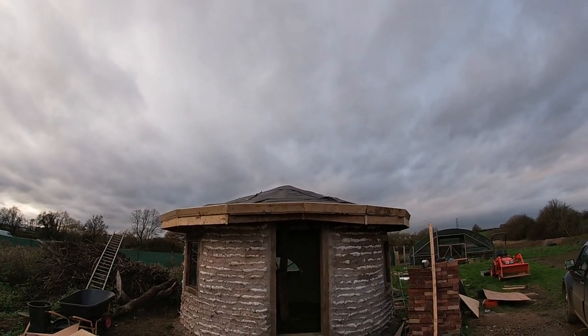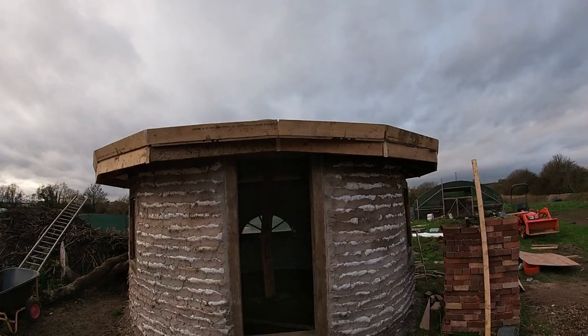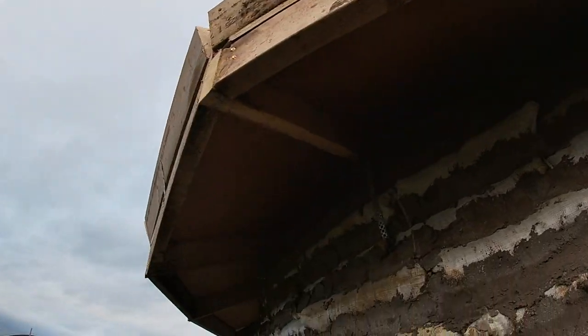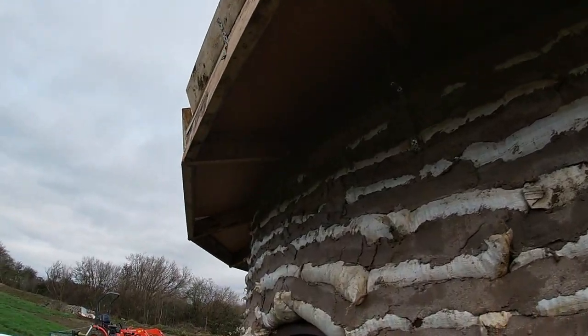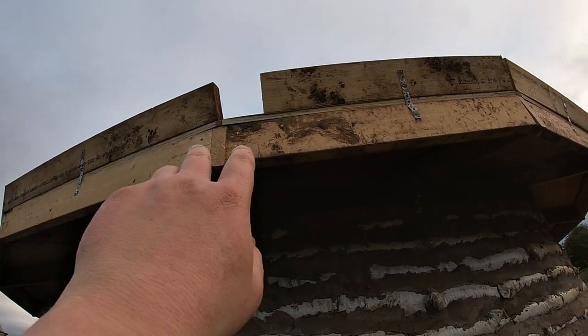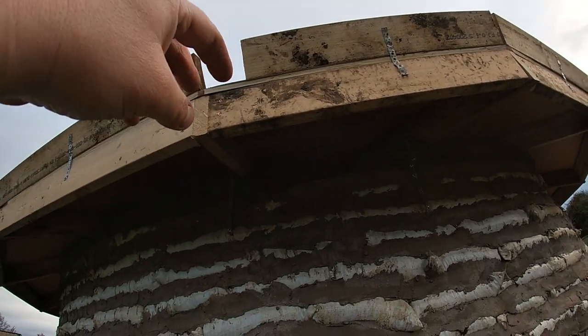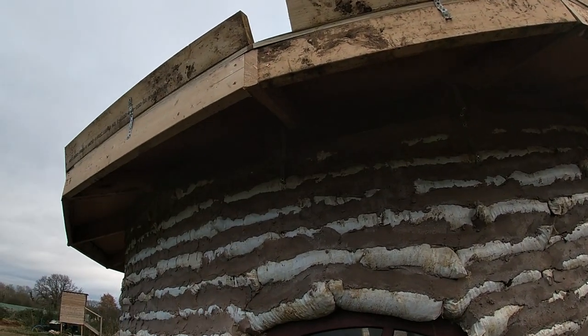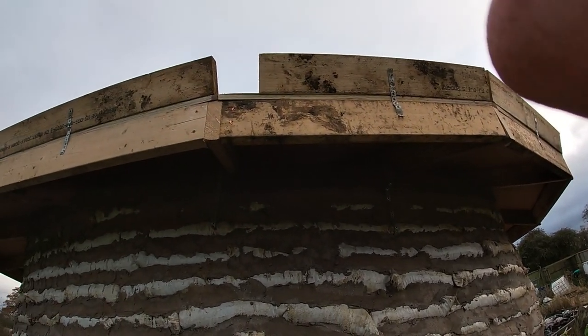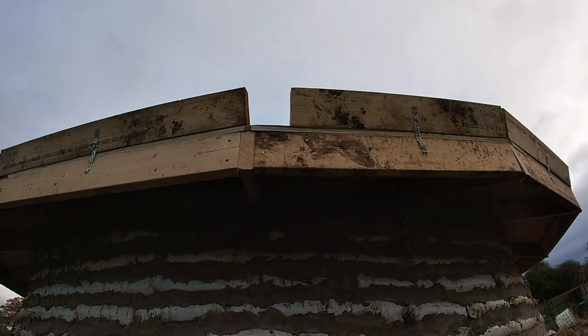Got the roof done. I'm going to put my extra six inches on to stop the green roof sloughing off, and I've left a good gap here to create an outflow through that gap with the plastic sheeting, so we've got a drain on this one side only. The whole ring around the outside becomes the gutter as well, so I should just have water coming out of here. I'll do a little demo of how the gutter is going to work in the next video when I actually put the covers on and put the green roof in.